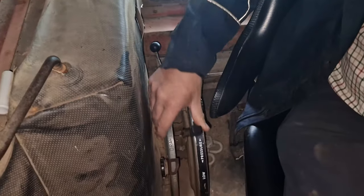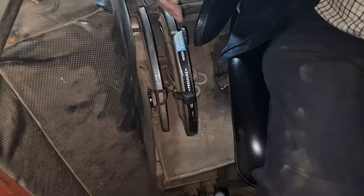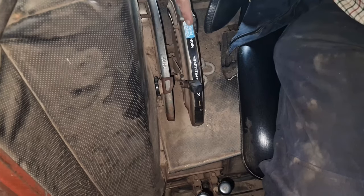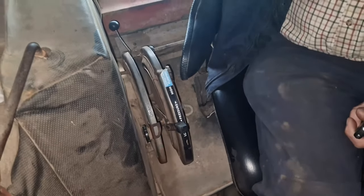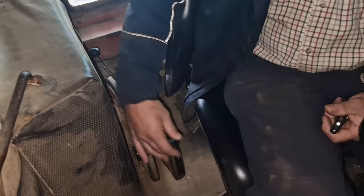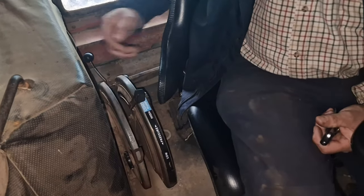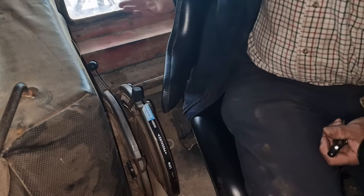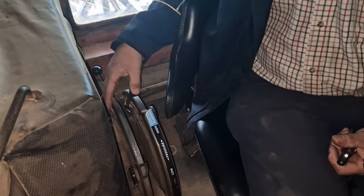If you push that forward, what that does is lift the arms up and then puts the pump into pump - that's the amount of flow for tipping trailers, or if an implement has a constant flow and return. That's how you regulate your pressures, and then into the high point that says constant pumping. But the arms have to be up on the Masseys for that to happen.